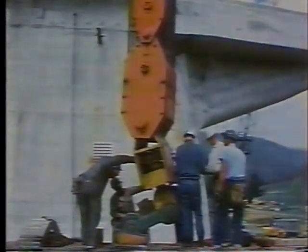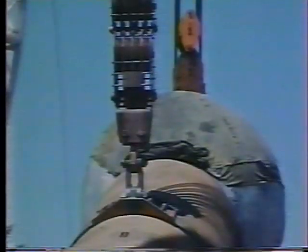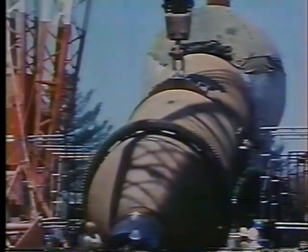It is now possible to start erecting the telescope. The assembled shaft and sphere are the first to be rigged to go in the air. A problem with lifting the sphere and shaft into place was to locate the pick points so that at the final rest angle of 38 degrees and 27 minutes, neither derrick would be overloaded. The weight of the unit is 386 tons.